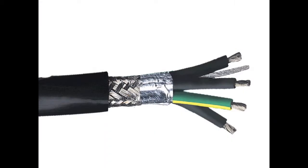There are several constructions of Belden VFD cables depending on your application. The classic VFD with the full size insulated ground is constructed with three stranded tin copper conductors with an industrial grade XLP insulation, a full size insulated ground, a tin copper braid shield and a PVC jacket.